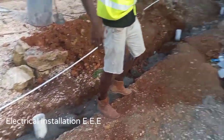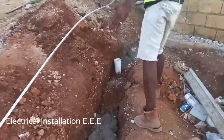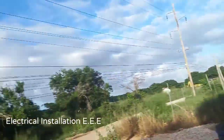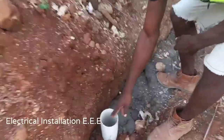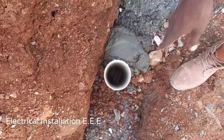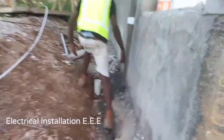That is one of the main reasons why we do underground mains — so you won't see a wire in the air from the electricity supply to the building; it's buried under the ground. Here is another point to show the electrical inspector the depth — this is to show how deep the pipe runs. And this is where we have our junction boxes.